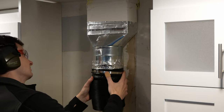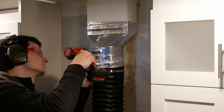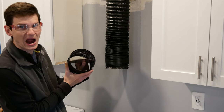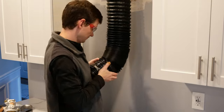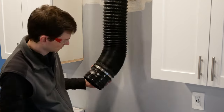I connected a flexible duct to a duct coupler, secured it with a hose clamp, and sealed it with foil tape. I inserted the duct coupler into the existing ductwork, pre-drilled it, screwed it together, and sealed the seam with foil tape. I made sure the flaps on the backdraft damper would open up away from the fan, inserted it into the flexible duct, and tightened the hose clamp on it. This damper has gaskets on each end so there was no need for foil tape here.